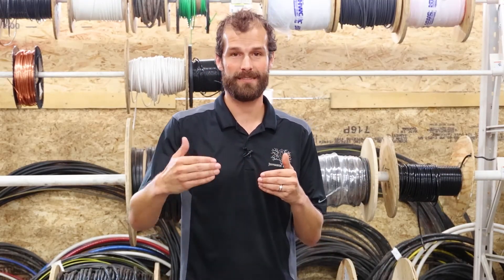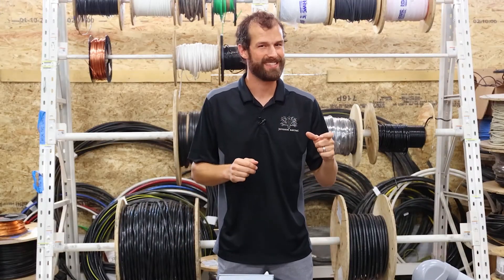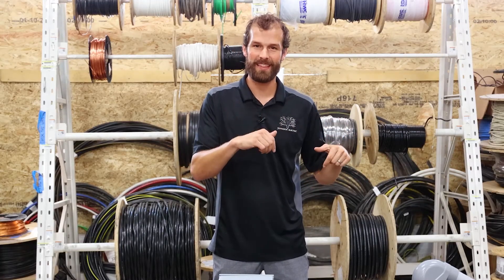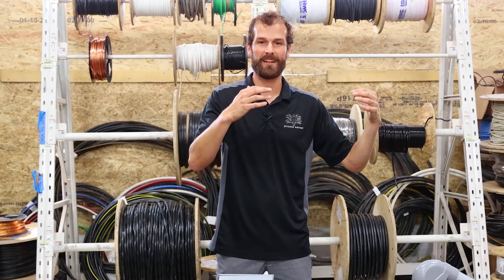For underground requirements, sometimes directional boring is required because there are alleys, sidewalks, or other obstructions. That directional bore will utilize HDPE conduit, which is color coded — black with a red stripe per utility requirements — because every color indicates something to an excavation professional. Typically 36 inches of cover are required over the conduit or cable. Cover is dirt on top of the electrical system — physically 36 inches of dirt. When backfilling, backfill about 10 to 12 inches at a time, tamp it down, to minimize settling later.